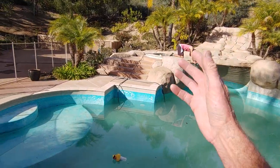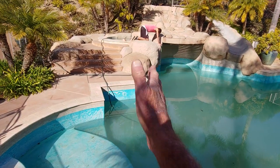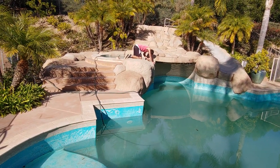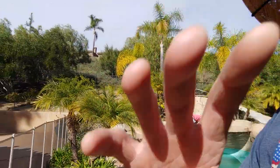There were some cracks in there that we fixed as best we could. We grind them in a dovetail fashion so they open up as you go into the crack, then push in high-strength mortar and you're good to go. That's another one in the books — Mr. Dave on the rock pile again. Wherever you're at, hope you're having a good day. Remember to be thankful and forgiving no matter what. The light will overcome the darkness in the end, and we'll fight the good fight for freedom in America.